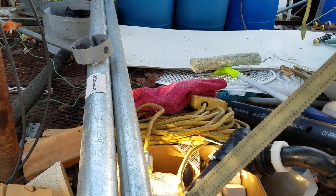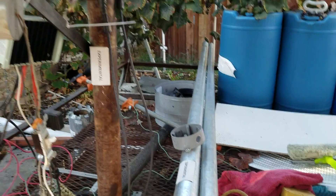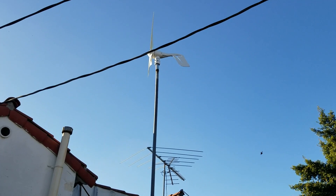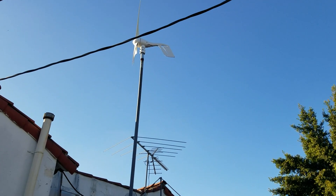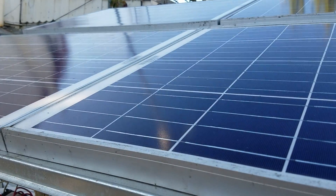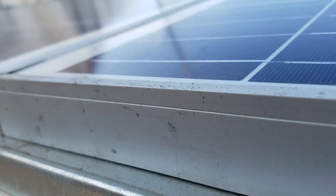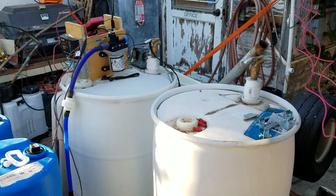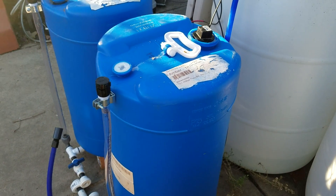We had wind earlier today and yesterday, and my turbine was spinning and I did get electricity out of it. I put a temporary pole up there and mounted my wind turbine just to see if it works, and it did. The wind's not strong enough right now to be turning it, but it does work and it outputs electricity at 400 watts. So that and these six 100-watt panels will be giving me 1 kilowatt of charge power going into my battery bank. Then I'll have a separate 100-watt panel going into this solar water heater setup, and that single battery is all that's going to be needed to produce my hot water.